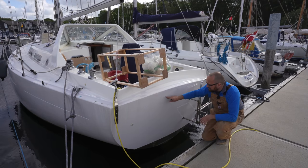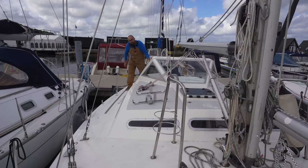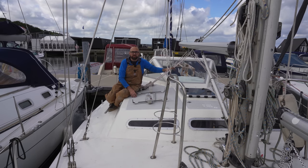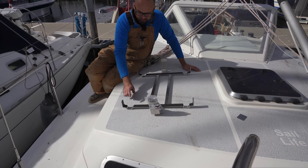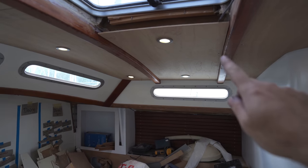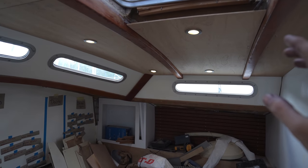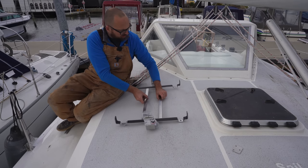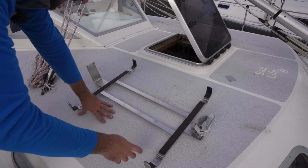When I painted Athena I found some holes in the transom that looked like there might have been a life raft mounted down there at some point, but that's very close to the water. I can't use the port side because there are lines led off to the cockpit over there, so the starboard side of the cabin top is the only real option. The good news is that mounting the cradle is going to be very straightforward — just four bolts. The only thing I need to be aware of is not drilling into the two laminated beams right here. I am leaning towards the forward option, so this is roughly centered — let's go ahead and drill some holes.